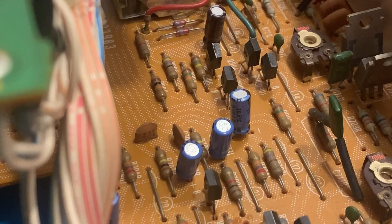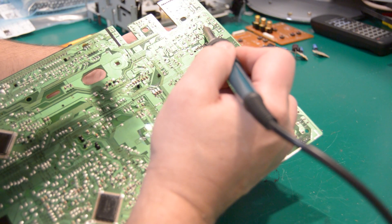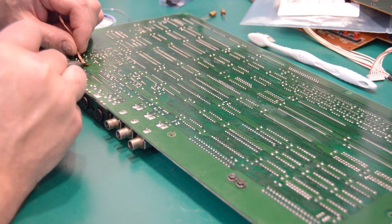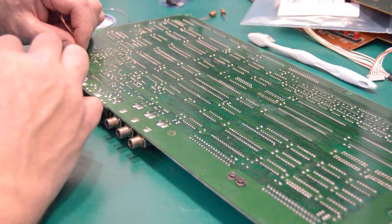For anything with two to three legs, you can simply melt new solder on and then, while heating the solder joints, pull the components out from the other side. For those harder areas and double-sided boards, you can also use the soldering wick.